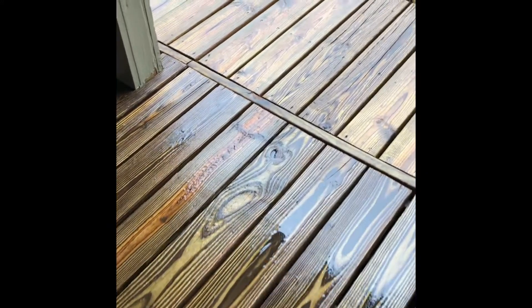We have finished the application of oxalic acid, or wood brightener as some would call it. As you can see it lightened up quite a bit, and as it dries it will continue to do so. While we're waiting on this to dry so we can apply a stain, it'll continue to lighten and open up the pores in the wood so it will accept a sealer. Just look how beautiful that turned out. A lot of people would tell this customer that this deck needed to be replaced — and it's not from ill intent, it's just from inexperience. You won't learn it overnight, so don't get frustrated if you screw a few up. You can always fix them. It just takes time.